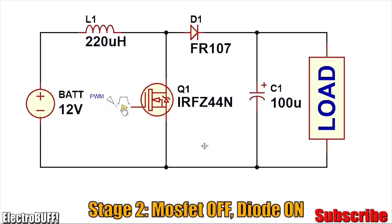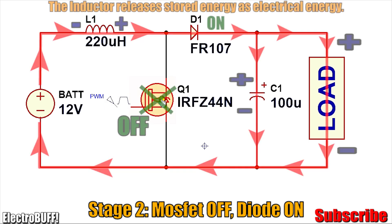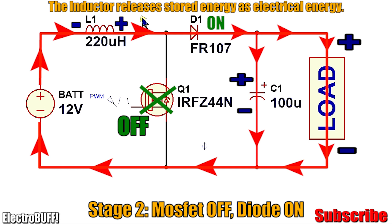After some time, a low pulse will be sent to the gate of the MOSFET from the control circuits and it will turn off, cutting off the current flow to the negative terminal via Q1. Because an inductor tends to maintain current flow steady, this will force the voltage polarity across it to reverse — negative here and positive here. Now the voltage across the inductor and that from the power source are in series, forcing D1 to conduct because it's now forward biased.